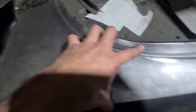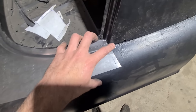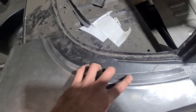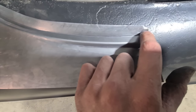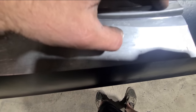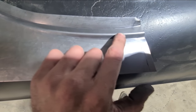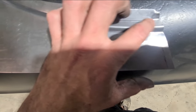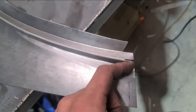I need to tip this up here where I've marked before I can let it go in — it's telling me it needs to come forward more but I can't because I've not tipped it up yet. The easy way I'm going to do that is just slit along each fold so it'll allow me to roll the piece over. Otherwise this area won't like folding — it's just too strong having a bead rolled the whole way along. So it's slit — fold, fold, trim that edge off, then trim this where it needs to be.